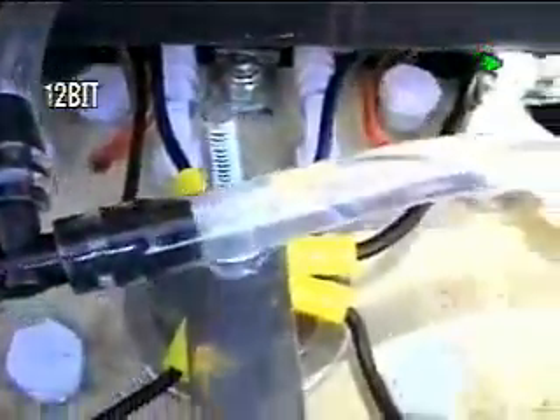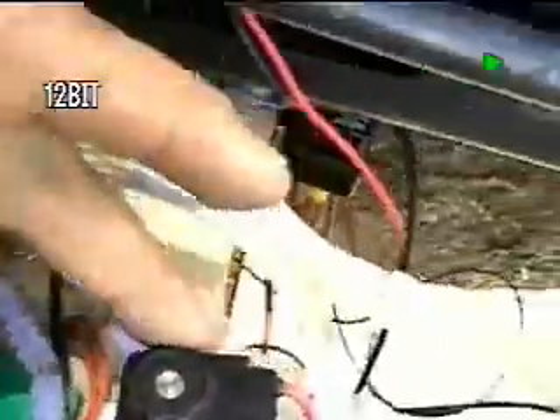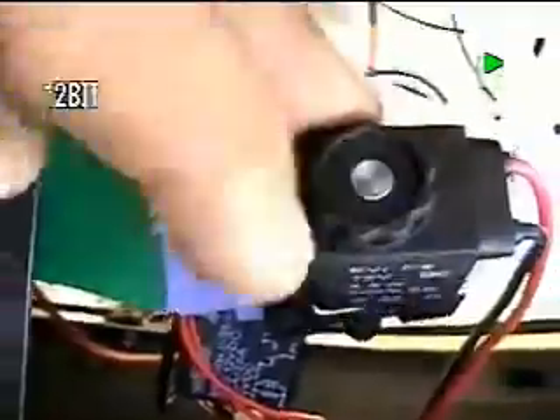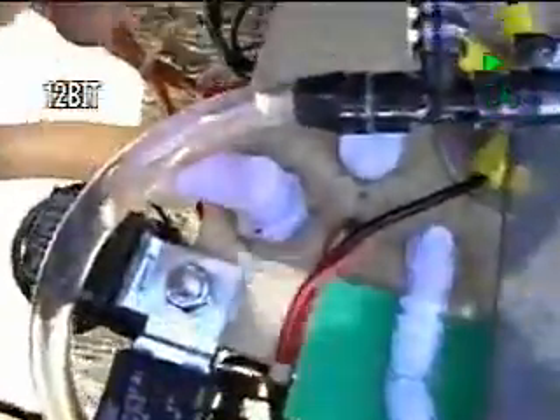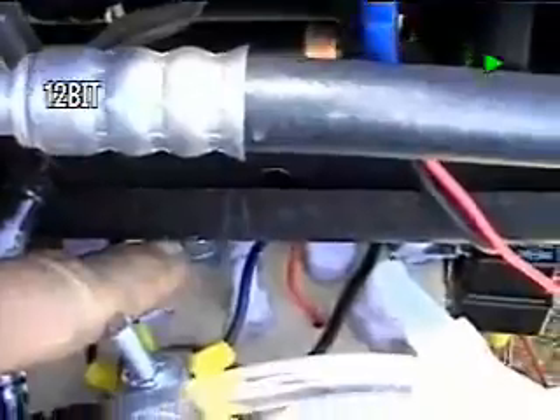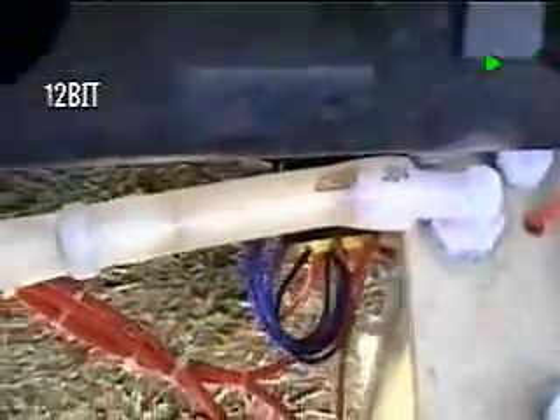So you know what a super gen can do. Now imagine four super gens all working together at the same time, controlled by a series of relays. Here's a water solenoid switch right here. If you look closely, there's a pair of solenoids — two here, one and two — and you come over here and there's two here, one and two. And two more in the back, and two more back there. In the center back, off that bolt, there's a master relay. You can see the harness that comes up and feeds one, two, three, four amp meters, and they come out of the amp meters and go to the master bus.